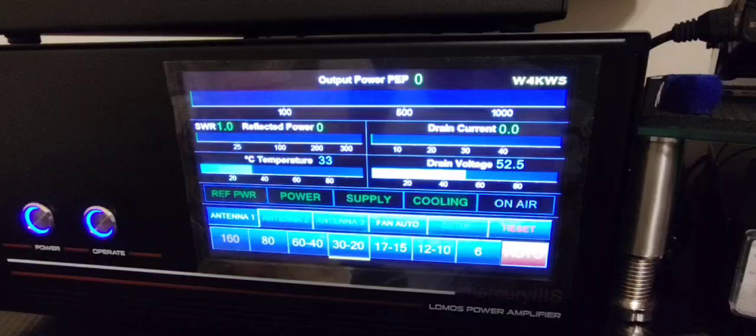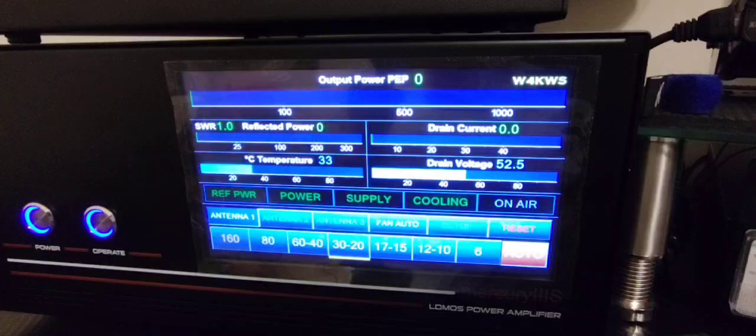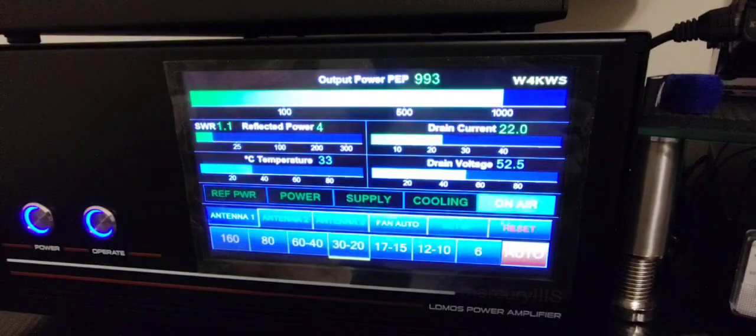What is up to 5 and 9 right now? It can move a little bit north of 1.3, but I don't run it that high. I typically run 550. I'm only pushing about 1 kilo right now. The antenna is an off-center fed dipole, inverted V configuration about 38 and a half feet up. And yeah, the secret weapon here is all the salt water where I'm at. QSL.